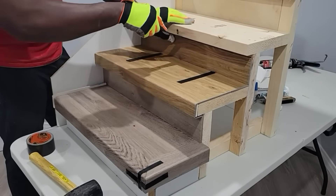Our next profile we refer to as our square profile. This is our most common purchase. This is made out of any vinyl that has a rigid core — SPC, WPC, LVP — lots of different coatings for it. But if it has a rigid core, then this is what we're going to be able to make for you. The inside diameter is slightly more than an inch and a half as our standard, and it can be customized as needed. That goes over most two-by-tens. You can see here for the installation, that back piece has already been cut and is going to be clicked into place before we add the adhesive.